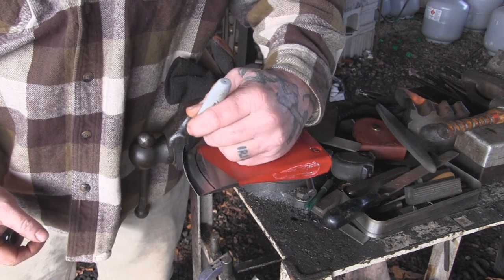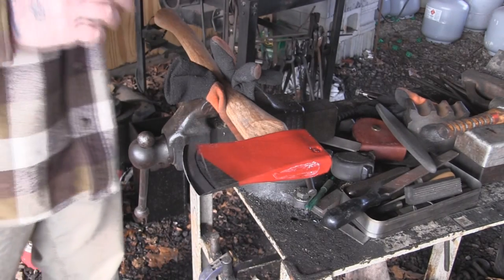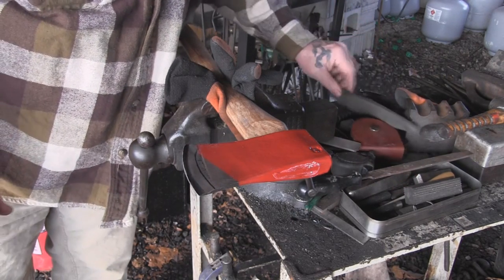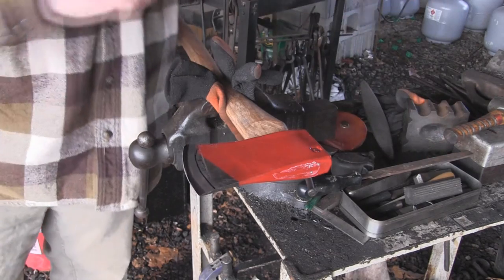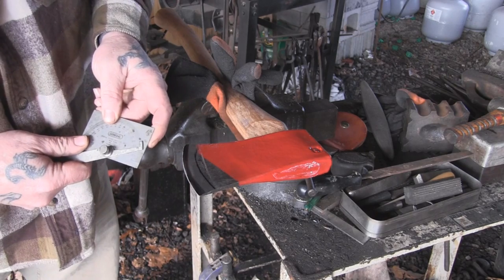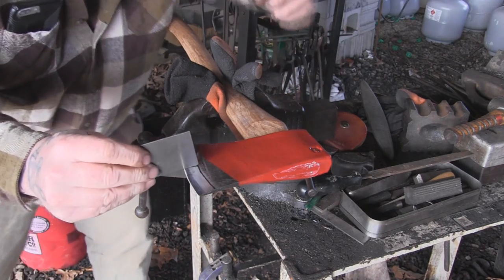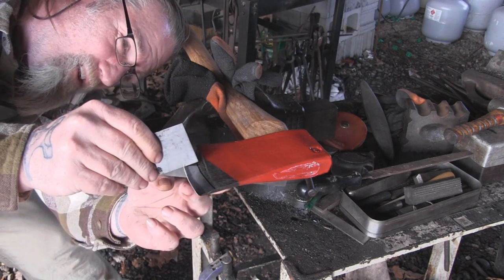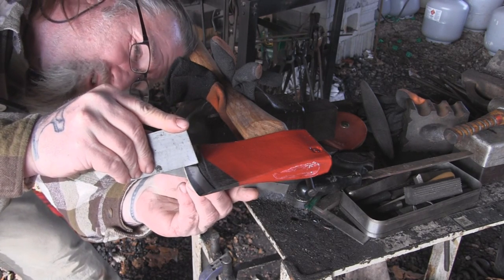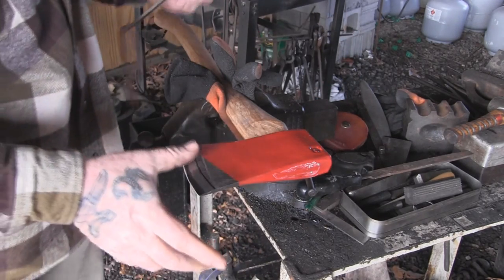And what we're really looking for here is a 30 degree grind on this axe. And we can measure that with a protractor or a scale of some kind, just taking a general scale and putting it at 30 degrees, just like that. And that mouth right there opening is going to be 30 degrees. And right now, we're pretty close to that actually, when you stick it right in there. So that's good. So we're maintaining an angle, and that's a good thing.